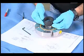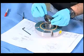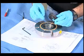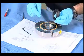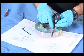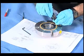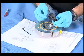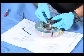Now I'll stop and record all of the deviations and interesting observations about this carbon, knowing full well that mark might be really hard to find a week from now. Now that I have this mark I can look at how this slot compares to this drive pin, and if there was another drive pin I can line those up — was there any wear relative to the flush ports? I can use that same pinch method on this dynamic o-ring and then immediately record all the observations about that o-ring. That's how you build a good set of observation data.